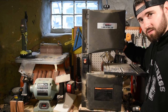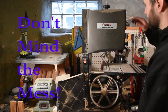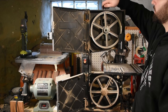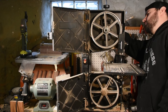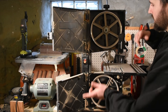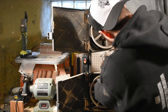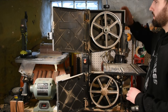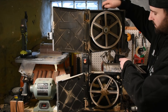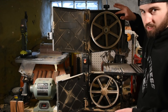Changing the blades on this bandsaw is pretty easy — just like any other bandsaw. Open up the doors and it exposes the two wheels. This knob right here adjusts the blade tension. Loosen this knob up and you can take the blade off, put a new blade on, then tension it back up. You want a decent amount of tension so you don't get too much blade deflection — not too much, but not too loose either.